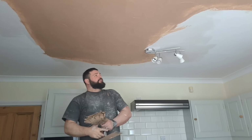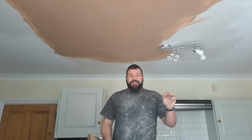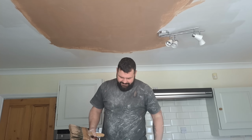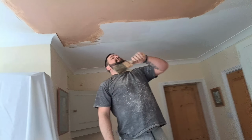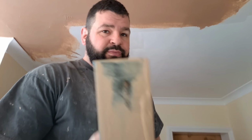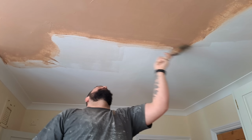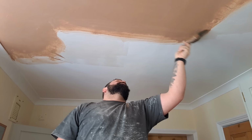And that's it flattened in with the blend addressed. Now, every single time you trowel it, you've got to concentrate on that blend again up until about the polish, and then it will stop tearing. Right, on the first wet trowel now. Your tearing will start calming down each time you go over it, it won't be as severe.